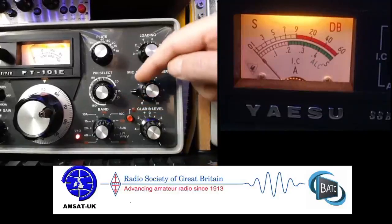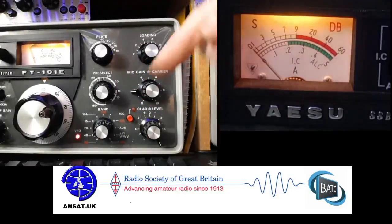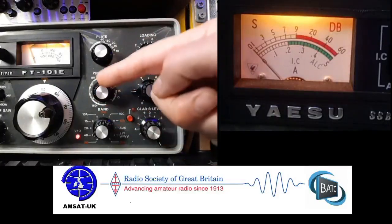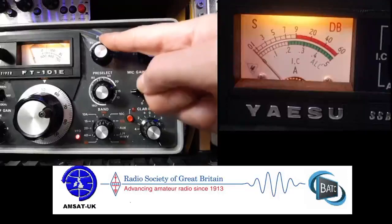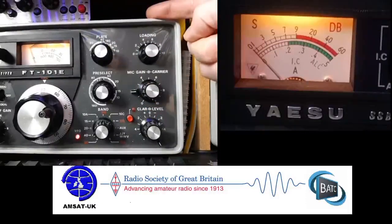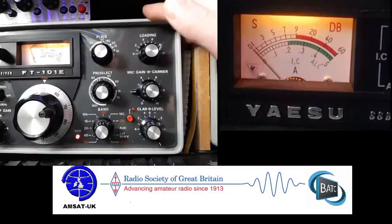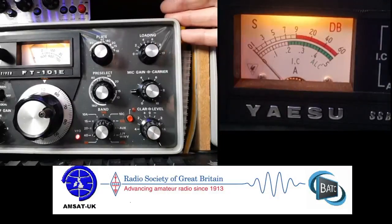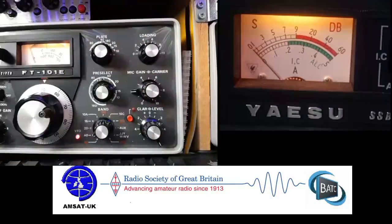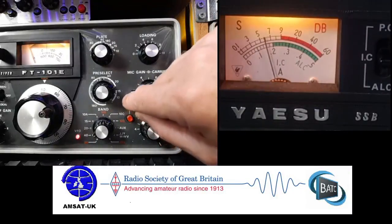If you're not used to it, you can bring the carrier up in one increments. Start at two, then three, then four, five, six, seven, eight, nine — I don't use ten. Make sure your band's set; preselect on the antenna to get the best reception. Set your plate to inside that 40 metre segment, and I always put loading at four. Read the book for the recommended loading settings for each frequency, but I always leave it at four and sort it out from there. It works for me. So we're on the dummy load. Key down. What we want to do — look at the meter — it's switched to idle current. You want idle current of 0.2, so just bring it up until it reads 0.2.